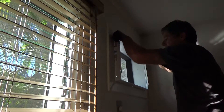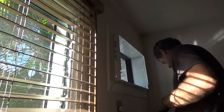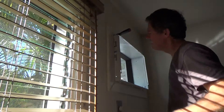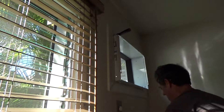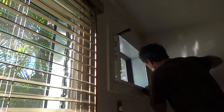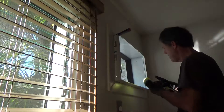I'm putting the first screw in on low. I've got an inch and an eighth right there, but it's moving on me a little bit, so I can take my putty knife to hold it out and check it to get an inch and an eighth. But I like to do the bottom ones first, so I'm going to come over here, measure an inch and five-eighths, and screw that one in — sometimes you have to use your left hand.